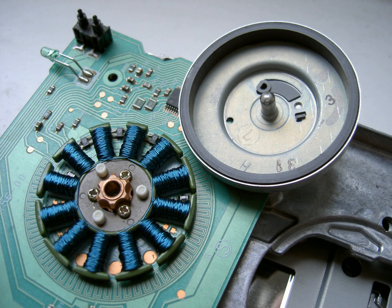In all brushless motors, the coils are stationary. There are two common electrical winding configurations. The delta configuration connects three windings to each other in a triangle-like circuit, and power is applied at each of the connections. The Y-shaped configuration, sometimes called a star winding, connects all of the windings to a central point and power is applied to the remaining end of each winding. A motor with windings in delta configuration gives low torque at low speed, but can give higher top speed. Y configuration gives high torque at low speed, but not as high top speed. Although efficiency is greatly affected by the motor's construction, the Y winding is normally more efficient.